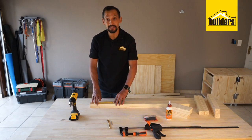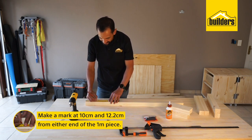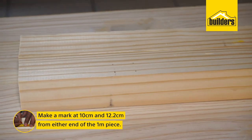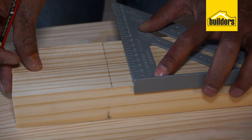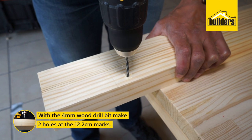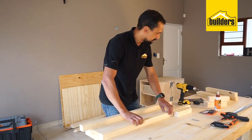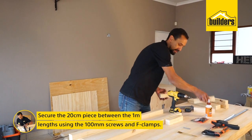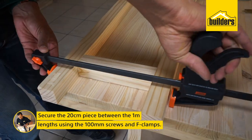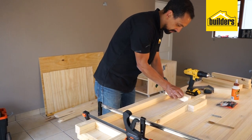To get started on our rope bench, we'll take our one meter length and make a mark at 10 centimeters and 12.2 centimeters from either end — that indicates where we'll attach our 20 centimeter pieces of pine. With your 4 millimeter wood drill bit, make two holes at the 12.2 centimeter marks. Then carefully secure your 20 centimeter piece of pine between the one meter lengths using 100 millimeter wood screws and your F-clamps to secure it safely.